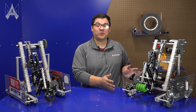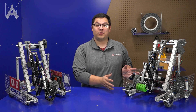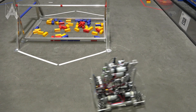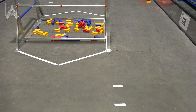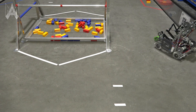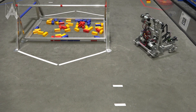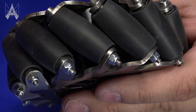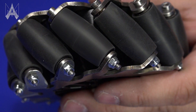This is another Robits Into the Deep robot with a few upgrades. One thing we've done is upgraded its drivetrain — it now uses mecanum wheels to get around the field. Over the years we've noticed that mecanum wheels are incredibly popular and useful in an FTC environment, providing the ability to move forward and backward, turn left and right, and strafe. These are our four-inch BB mecanum wheels, and they have ball bearings in all the rollers which allow for an incredibly smooth roll.